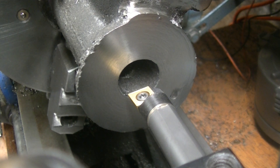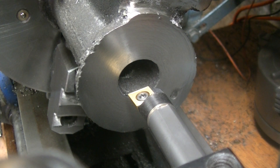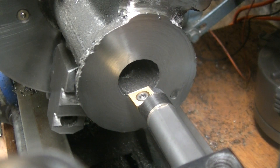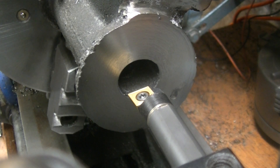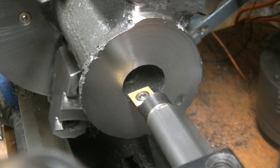Here's how I'm going to initially try to do this: we're going to go in halfway down the bore, then flip it over and go the other halfway. That's not going to be perfect, but we're going to keep at it until the hole is big enough to fit this big boring bar. The actual piston is an inch and a quarter. This bar here can only make a hole as small as an inch and 115 thousandths, so we should be able to flip it, do half, flip it, do the other half until this is big enough to go in — and then the big bar should be able to go the full way. I'm going pretty slow.